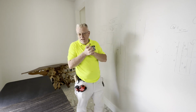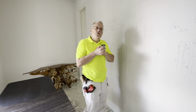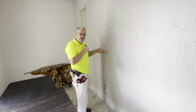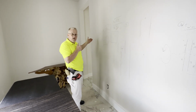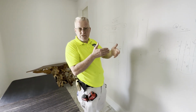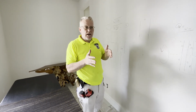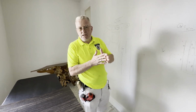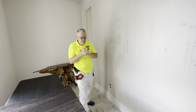Now, do you have to really hang the first sheet in the middle? No. You could simply put lines where the edge of the first sheet will go and work yourself back to a more comfortable place, if it is more comfortable to start on the left. You don't have to start hanging in the middle, but you must plan from the middle. I'm going to hang from the middle. I'll see you on the next frame when we're ready.